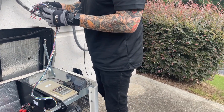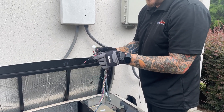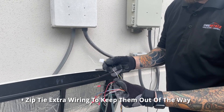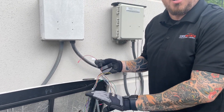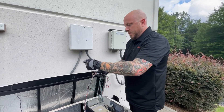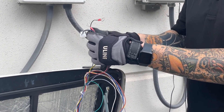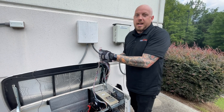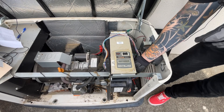For the Nexus controller, all we need is the 8-pin connector and the black wire and the red wire — those will be your power sources. Once you separate those wires, the other ones we recommend zip-tying off. You can clip them and put electrical tape, but just make sure these wires are away from everything else. All you need for this is the red, the 8-pin, and the black. Don't adjust any of these until you have everything connected and can move them out of the way — it's a lot easier to take more off than to try to add more back on.